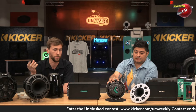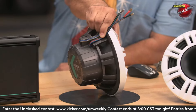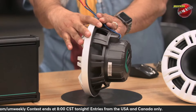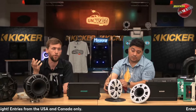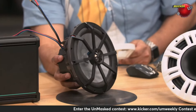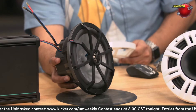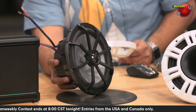We've also made that motor structure completely sealed on the backside so water can't encroach and get to the voice coil or the electronics of that speaker — two-fold protection with that kind of basket. On the front side of the speaker we removed the tweeter post, so if you look inside you can see the tweeter is held up by those spider legs in front, and there's no hole in the center of the speaker for water to get down to the voice coil.